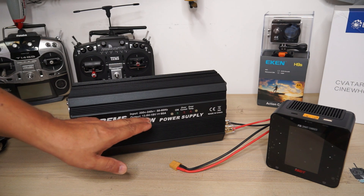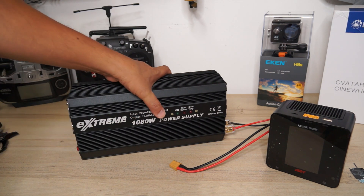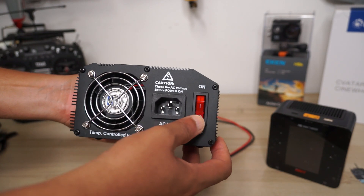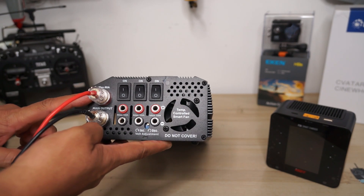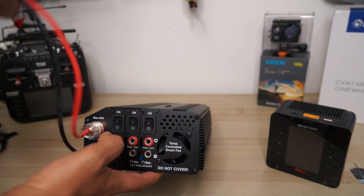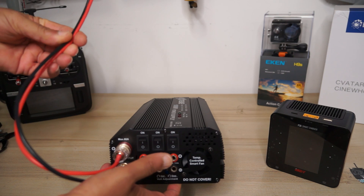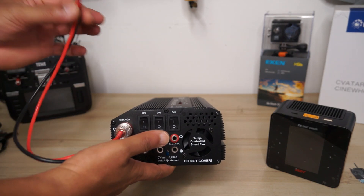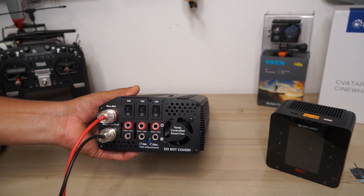This is once again 1080-watt max power, selectable voltage from 13.8 to 18 volts, and the output is definitely selectable. Here is the input — power coming from your wall outlet — with an on/off switch. On this side you have a main output which gives 60 amps maximum, and this is where I'll connect my ISDT P30 using an XT60 connector and cable. Some people have said to use thicker cable — this is only 14 AWG, and some suggest 10 AWG — but for charging I believe this cable is enough since I won't use more than 30 amps.